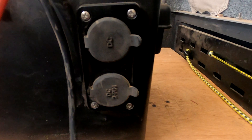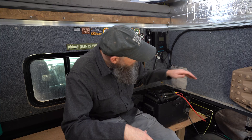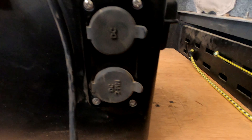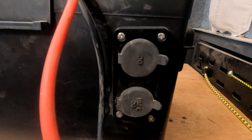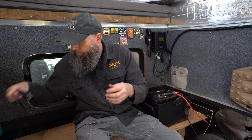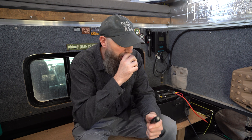With this open dead space over here, this is the Dometic 12-volt power plug system. We went ahead and just mounted that in here. What's cool about this little system is you have your typical DC 12-volt cigarette lighter plug, which is nice, and then this bottom one is actually specifically made for the Dometic fridge cord — so this powers our fridge right here, tied straight to the battery.